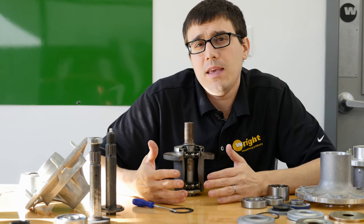You also have to consider how much grease you pump into that spindle — it's going to add up at $8 a tube of grease, plus the time and discipline of making that a weekly task that your crew has to do. If they don't do it, the spindle fails. A sealed system is trouble-free — it just runs and is very easy to manage. We've found that with a sealed dual-chamber system with an initial fill of grease, we're getting long, long life out of it. We also use a very particular grease that handles moisture absorption and doesn't get dry and cakey. Using high-end grease is also important.